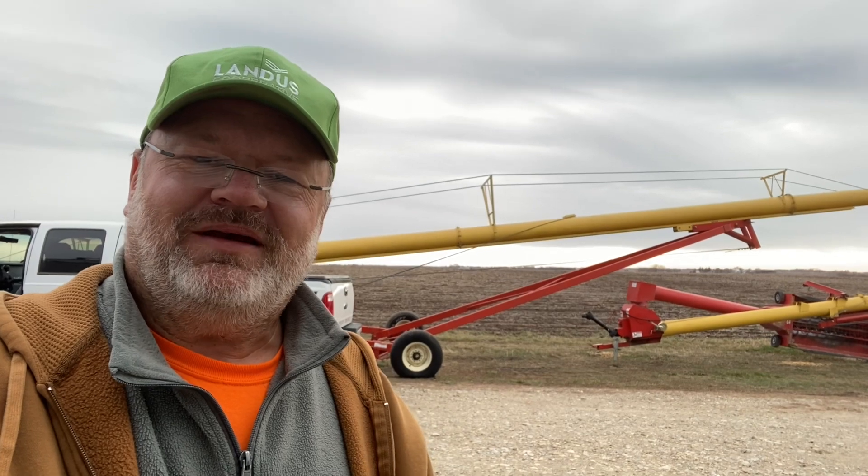Okay, well there you have it. We successfully activated grain augers on the air and found out a few things. One auger works pretty well. Two augers in a phased array configuration — which really wasn't a proper phased array since we weren't using coax or the right lengths, no formulas, just wire — didn't work, which is fine. But two augers daisy-chained together actually worked pretty well; we got Puerto Rico right off the bat. Anyway, had a good time, hope you enjoyed it. We might come back and do more — be nice to raise them up 45 degrees with a tractor and see what that does. Thanks for watching, see you next time. Bye.